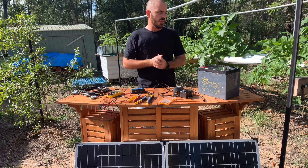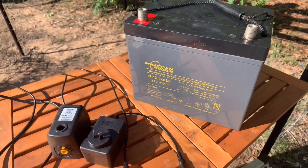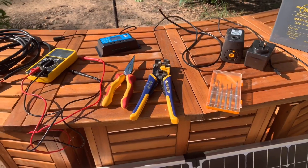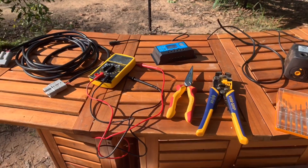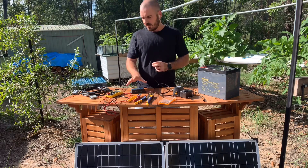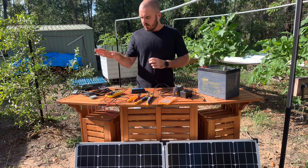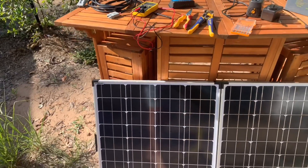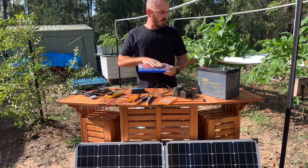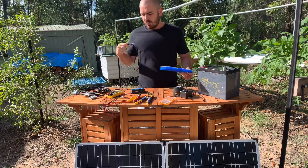As well as your water source, you'll need a 12-volt deep cycle battery, a 12-volt pump that has a head greater than your system height, some screwdrivers, wire strippers, pliers, a solar charge controller — this is just a cheap Chinese one but it will do for our purposes here today — a multimeter, an extension cable to run to your solar panels, and of course you'll need your solar panels. I'll also be using some connectors and some wire crimpers, as well as some automotive wire to connect all of the components together.